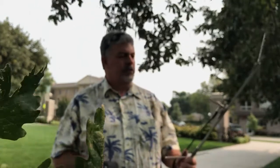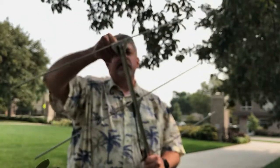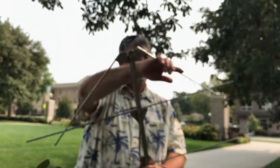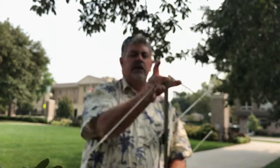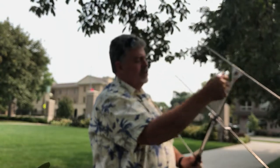I just wanted to show you a few things as we do this telemetry exercise out in the field for you to remember as you use the equipment. First, we've got our three-element Yagi antenna — that simply means it's got three parallel antenna elements. When you get the equipment it's going to be all folded up, so you just need to loosen these little hand washers and tighten them back up and you'll be ready to go.